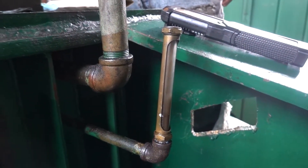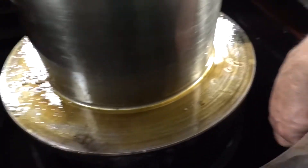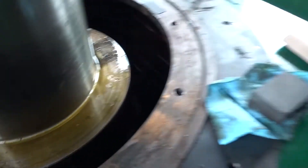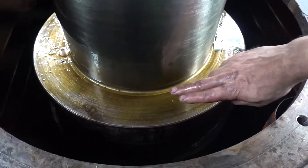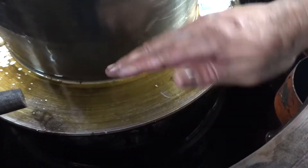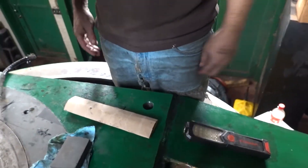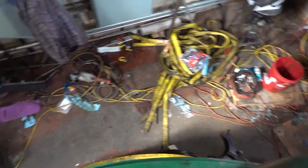If you put too much oil in, inside of here there's a stand pipe — it goes up about a half inch or so above this. If the oil level gets above there, it runs up, over, and down right through the center of the shaft — down the outside of the shaft, and just whoosh, everywhere, all over the powerhouse. And we've experienced the oil flung around the room. You can see the shaft and the bottom part of that can, and the oil coming down from there with the centrifugal force.